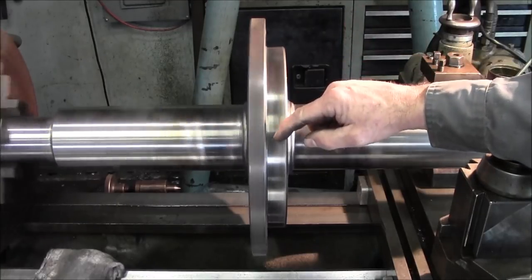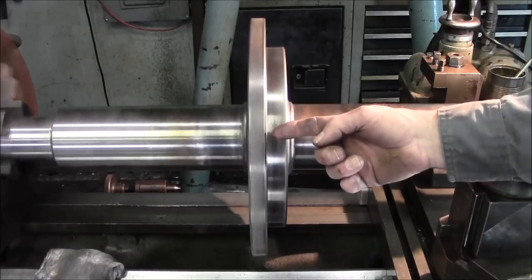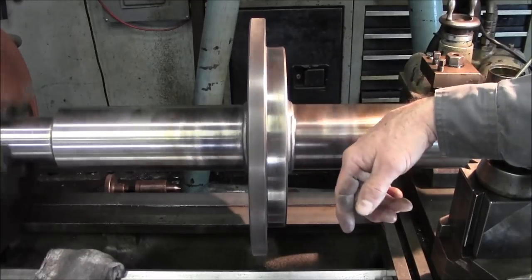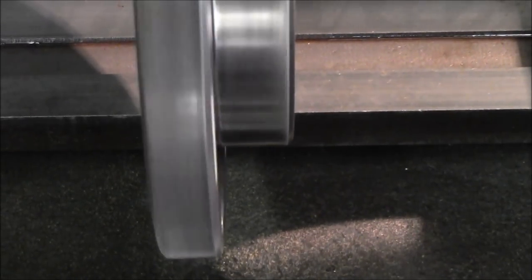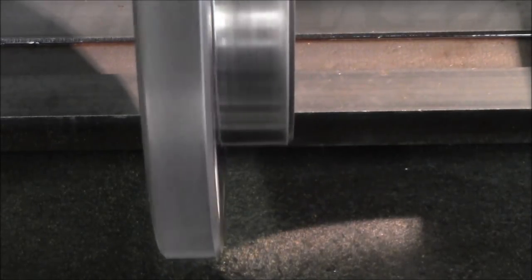There is no other way — we've got to keep this as a machine surface and that's a machine surface right there; everything else has to relate to those two items. We can take a skim — that five thousandths off that face is not going to make a difference on strength. That will be one of the last things we do, actually face that face. And there you can see the virtually straight-running shaft — it might have a couple thousandths runout on it.